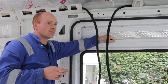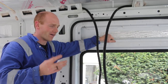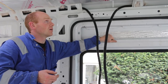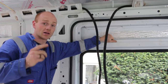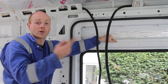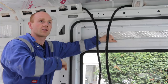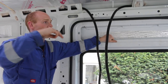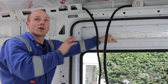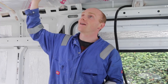Still getting my head around the whole 12 volt system. I can just about cope with house electrics, so I'll get my head around the whole parallel and series thing, because it's been a while since doing physics at school. But we want to run these three ceiling lights in parallel. They'll be coming via the wall switch, the master switch, and then going off in parallel — because if they were in series and we turned the first one off on the ceiling button, it would turn them all off. The negatives will come back and head back to the fuse board up at the top. So that's all of that done and we can now get on and panel the ceiling. Far more at home with sawdust than I am with watts and amps.